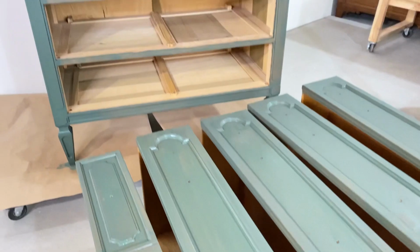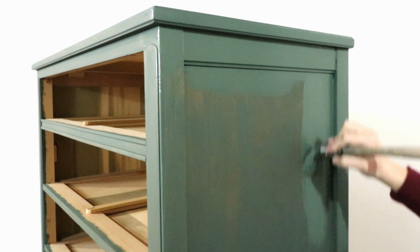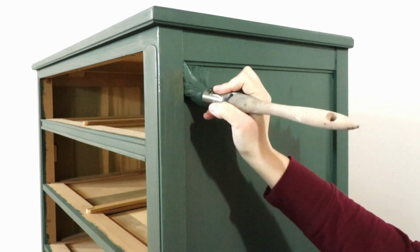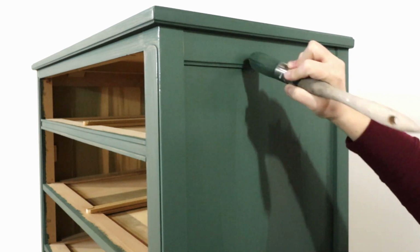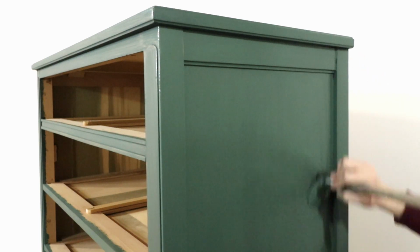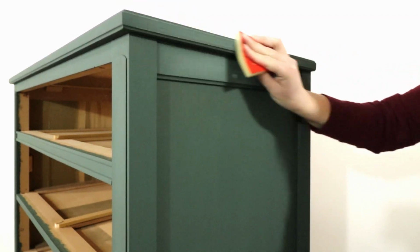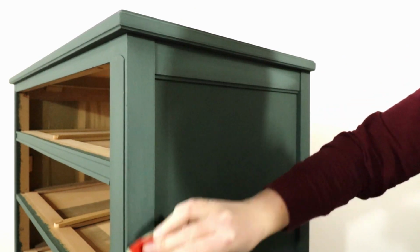It only took about an hour before I could paint the second coat. This paint has pretty good coverage and needed only 2 coats to get full coverage, even after I thinned it out. After the second coat was dry, I sanded everything down to help remove any brush marks that were made. And then things took a turn for the worst.